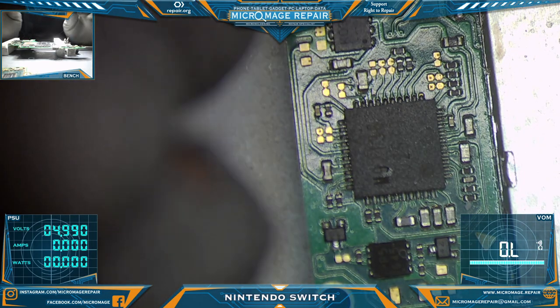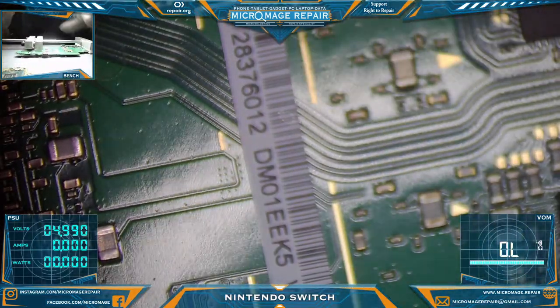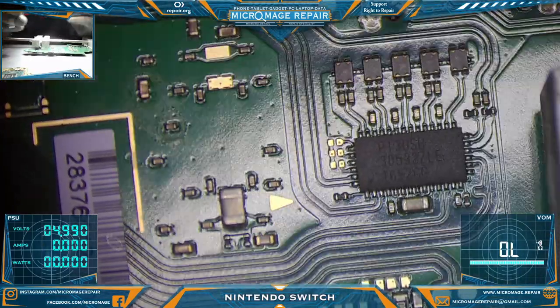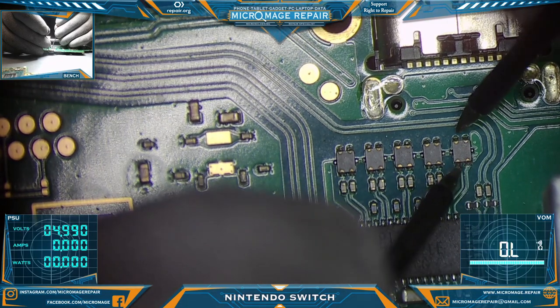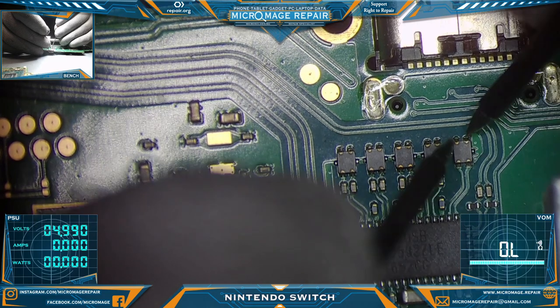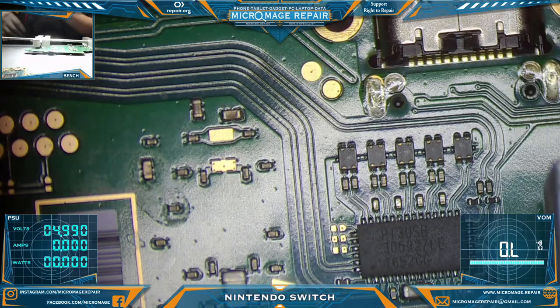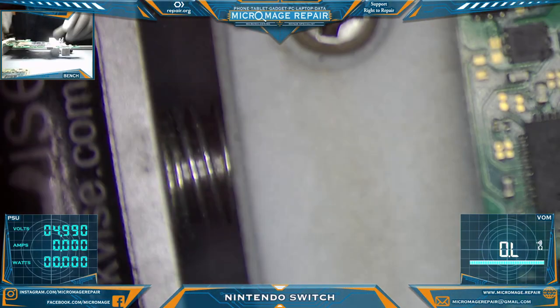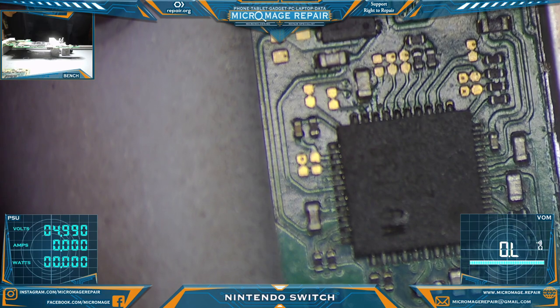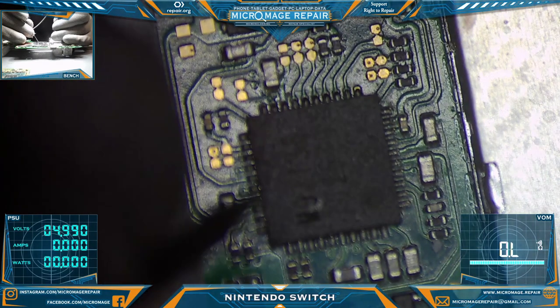Three things usually cause 0.0 amp draw. Here is one of them. And it seems fine. Okay. So I'm strongly suspecting M92 T36 at this point. It did have a little bit of liquid damage by it. It may have failed gracefully, because as we recall, we did not see any shorts. We'll check again just to be sure. Liquid damage definitely creates a lot of troubleshooting.